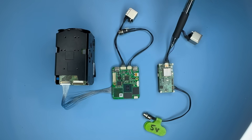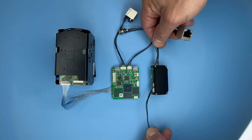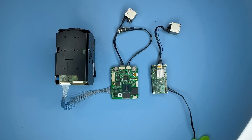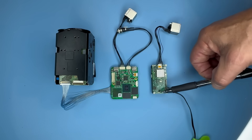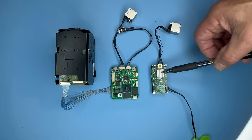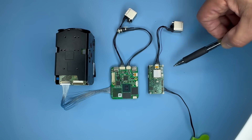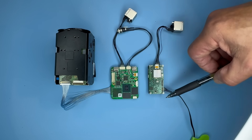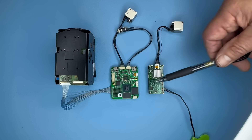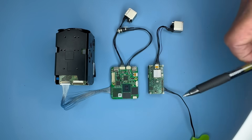Let me explain the differences. So the Nano — let me just pick it up and turn it over. This has a heatsink on one side and on the other side there is a motherboard and two mezzanines. You can see one is fitted and the other one is not fitted. This mezzanine is an HDMI mezzanine — you can see this miniature HDMI connector here. And then we can fit another high definition, quad analog, or single analog mezzanine on this side. So this would be capable of two simultaneous video inputs, or four analog and one HD.